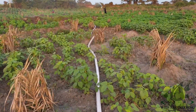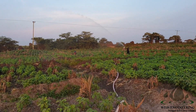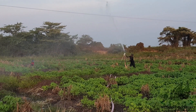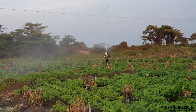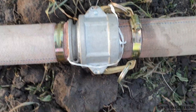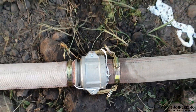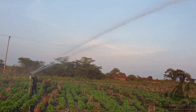This is the same movable sprinkler irrigation system whereby the canvas pipe can be moved, and water can be delivered to the garden with an HDPE pipe. This is a different make of sprinkler. We are trying to demonstrate how two sprinklers can work. These are our quick cam locks — we shall put other clips. These are high tensile clips, and this is a quick cam lock. When you disconnect, you just remove without need of any tool.